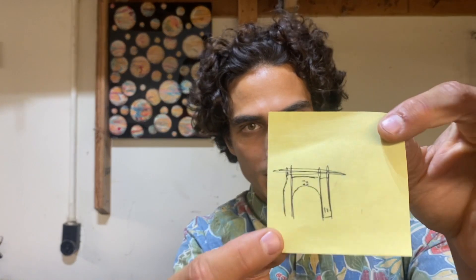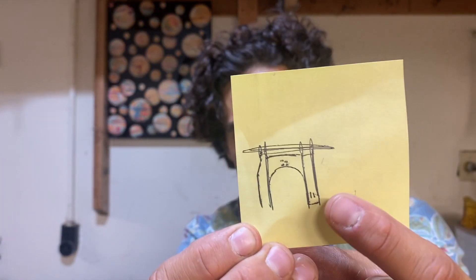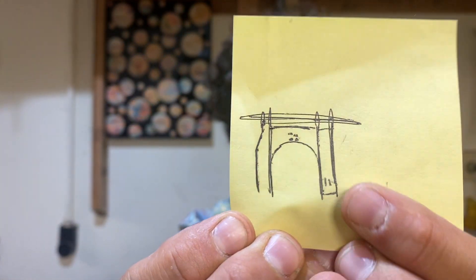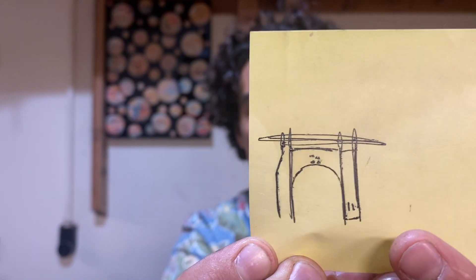Our plan is to take that exact same design and tweak it slightly. I've added some extra supports and beefed it up a little bit for the extra added weight of an Ape. You can see two notches in the back — that's going to be for a suspension mounting point. We'll mark that up on the computer, use CAD to design it, send it off to get the metal cut, and then weld it all together.